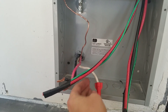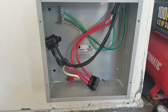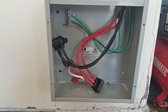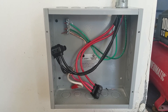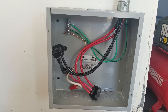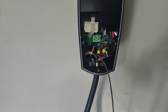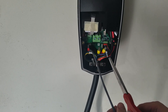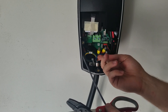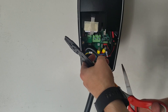The white wire we're just going to cut right off and not even use it — you don't need it. Now we can close this junction panel up and continue on to the wall connector installation. I've got the wire inside, the ground inside, my L1 and L2.